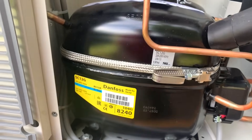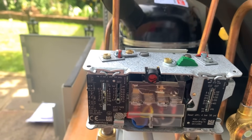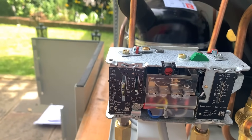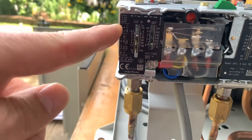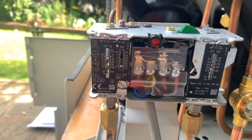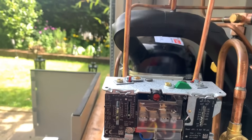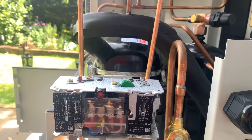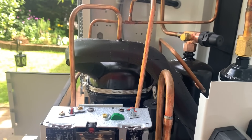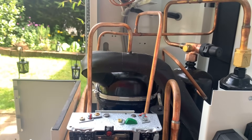Let's talk about the pressure switch. We have an HP/LP adjustable pressure switch, delivered in auto-auto mode. You can alter that depending on your application. The low side is here and the high side here. It is set roughly for the refrigerants but will need to be adjusted on site for your particular application. As a general commissioning point, always check all electrical connections are tight and make sure all service valves are in the correct position.